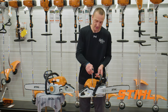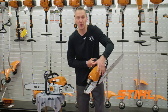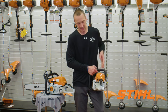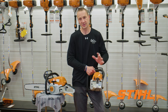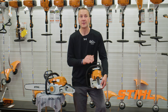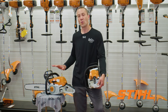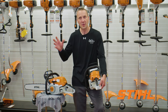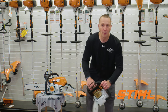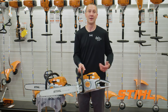Easy access air filtration — just a quarter turn on these top three screws: one, two, three to get to the air filter and the spark plug. This is where I'm really starting to like this saw — the master control lever. The whole start thing has changed. I squeeze the trigger, I put it down to start. This is where this saw is always going to start. I pull the rope two or three times and it's going to be running. I don't have to worry about missing that little pop and then continuing to pull and flooding it out. I just put it on start, pull the rope, it's going to start, hit the trigger, returns to idle, and I'm ready to go to work.